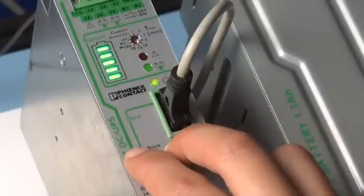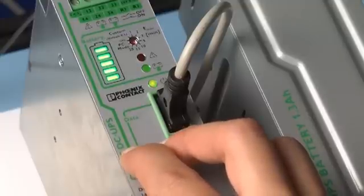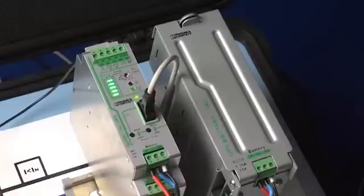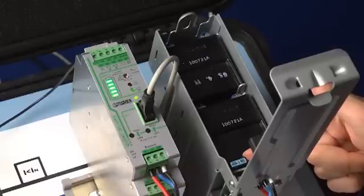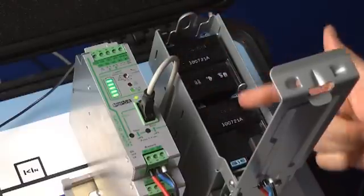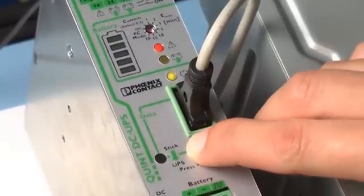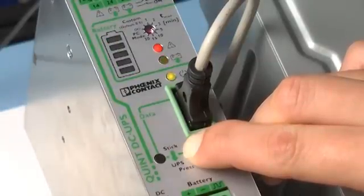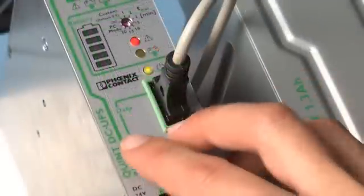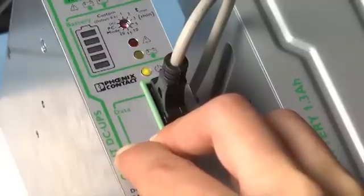Once it is time to service and replace the battery module, it is very easy to accomplish. The UPS needs to be placed into service mode to interrupt the charging circuit — press both buttons on the front panel for six seconds. Once the charging current is interrupted, it will be indicated by the alarm LED. The battery case is easily opened without tools. The fuse is removed for safety and then the battery cells can be replaced. Once the fuse is reinstalled, the housing can be closed again. The state of health is reset by pressing the upload key for six seconds; the battery level bar graph will flash to acknowledge the SOH reset. To reset the charging circuit, press both upload and download buttons simultaneously for six seconds. The alarm LED shuts off and the battery replacement procedure is finished.